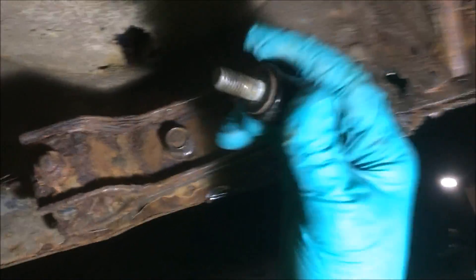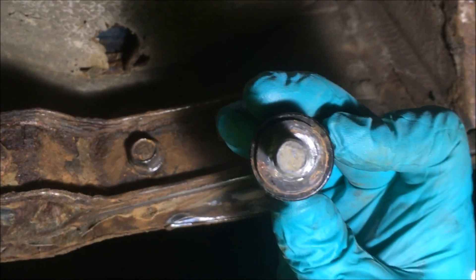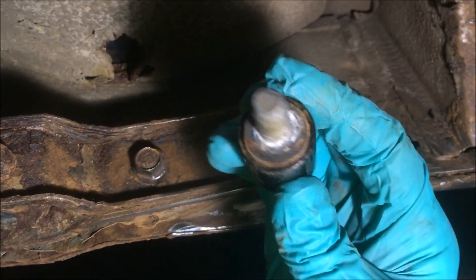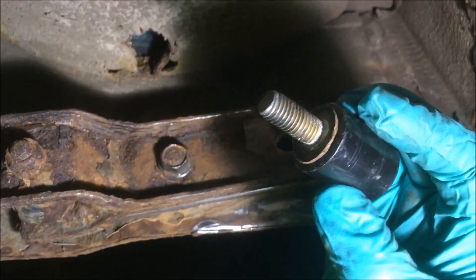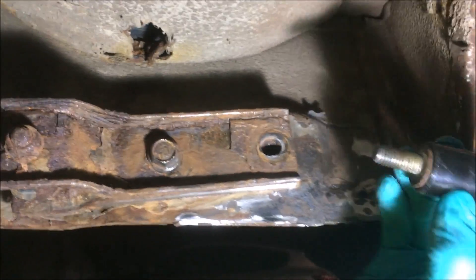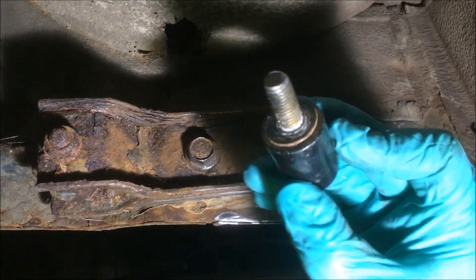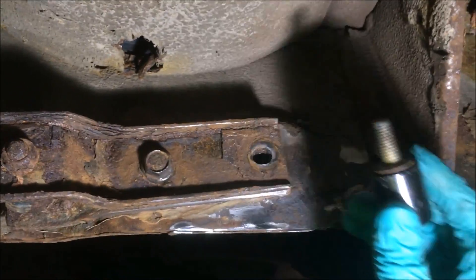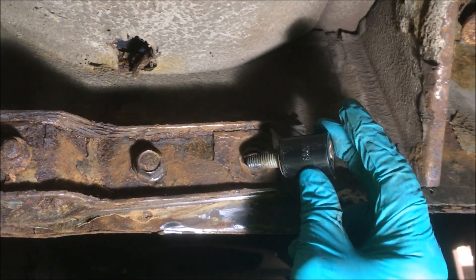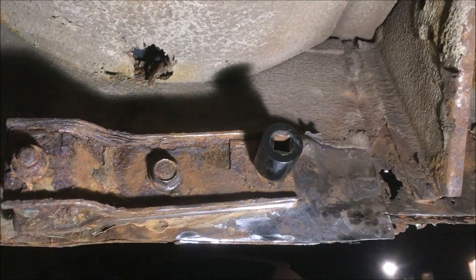One's stuck in the socket, but they're quite interesting bolts — rather than being round they're actually triangular in profile. They're called trilobular bolts, or they have another branded name like Taptite, something like that. These ones are past it because the heads are so knackered, but they're interesting bolts and I need to get some more. I'll either replace them with the same if I can find them, or just use a big bolt with a self-locking or spring washer.